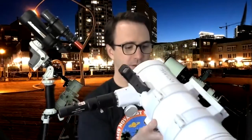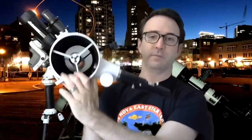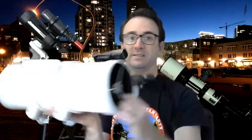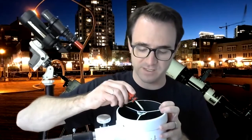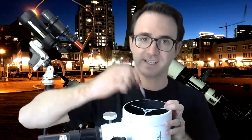So to do that, step one is you make sure that the laser beam is centered in the center of the primary mirror, and I can see that it is centered there right now. If not, what you would do is loosen the center screw here to loosen the secondary, and then you're going to adjust the position of that beam by adjusting these adjustment screws here, then tightening it up again, all while making sure the laser beam stays centered.